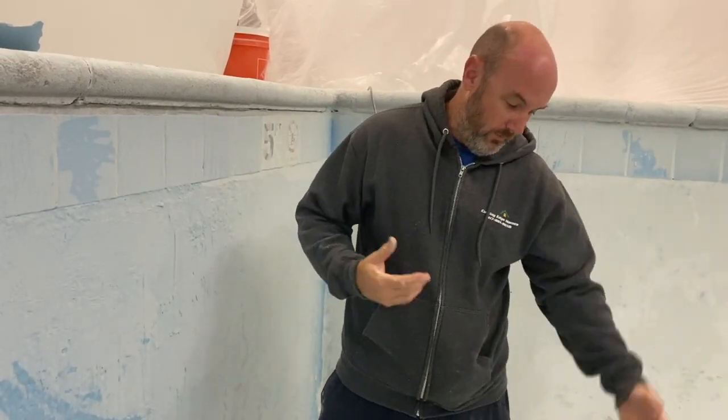And the Ecofinish process, just to give you a little overview: we got to get it down to a smooth substrate. It can be concrete or the plaster. We can go over either one. And we take a clear epoxy that is engineered to penetrate. We do a first coat that's a penetrating coat. We cut it with acetone so it's very runny. We run that on. A little while later we put a full strength coat of epoxy over that.